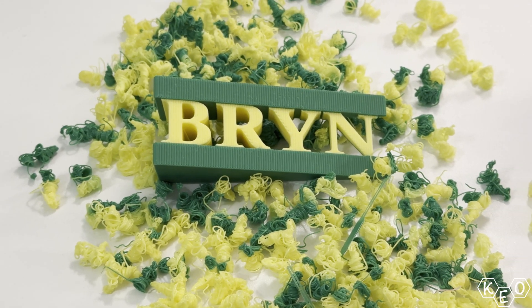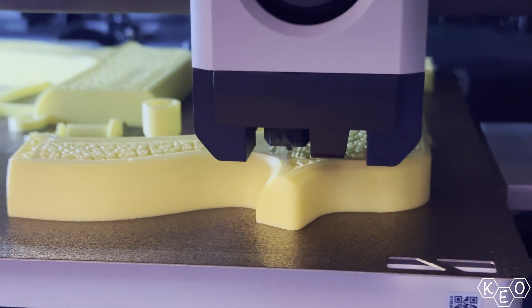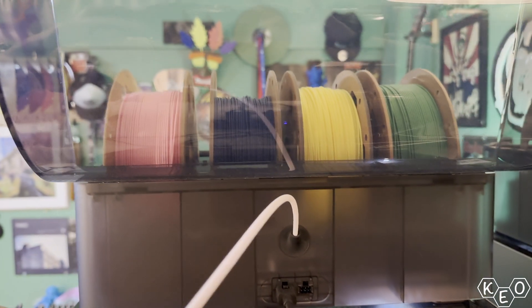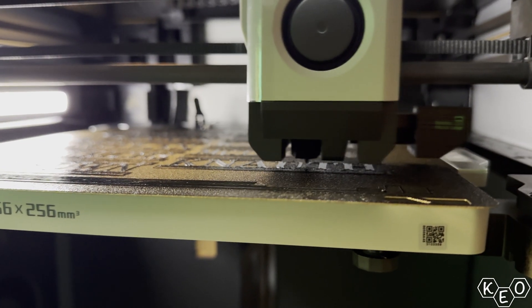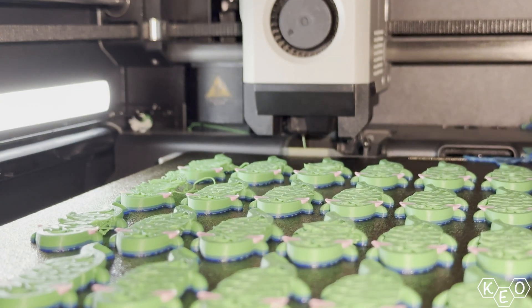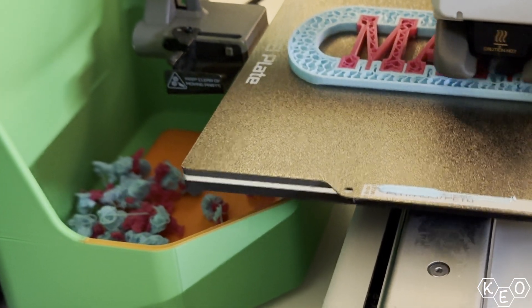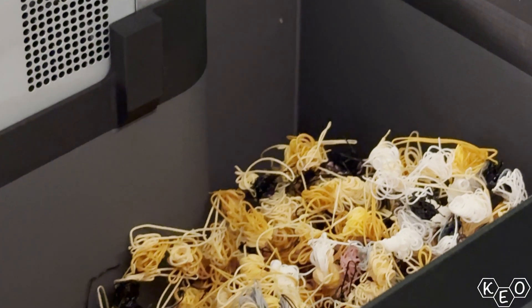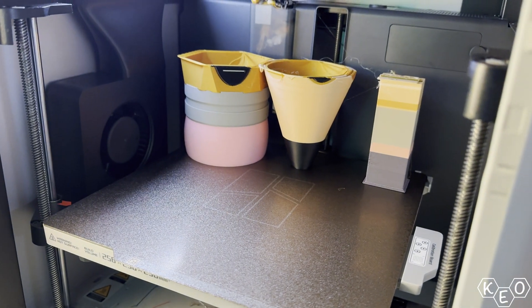This effect sees an even greater benefit when talking about multicolor models. If I have models that share the same two, three, or four colors — the same color scheme — I'm going to load the plate up with all of those models too. If I'm printing something that's black and gold with a color change every layer, I may as well put four of them on there and have the color change occur once for four models instead of once for one. The added benefit is all your AMS waste gets spread out across all the models instead of just one, making it more economical to print a batch of a multicolor model.